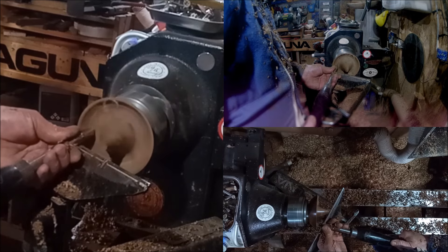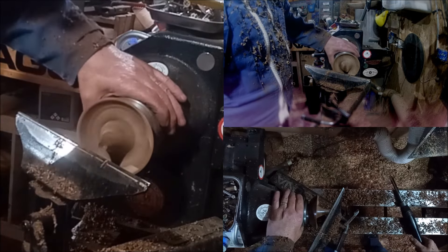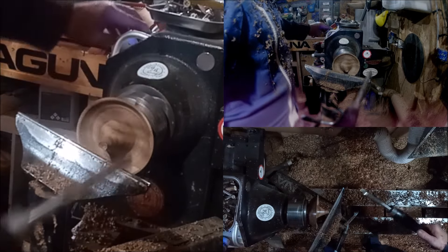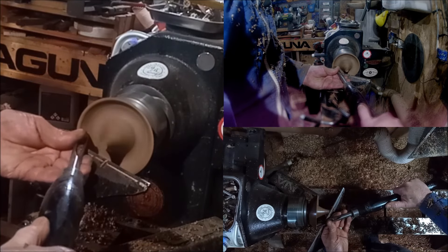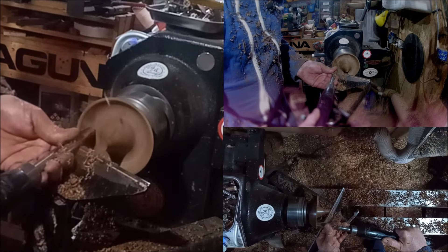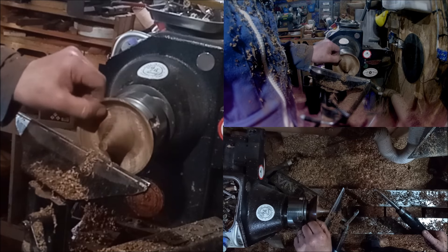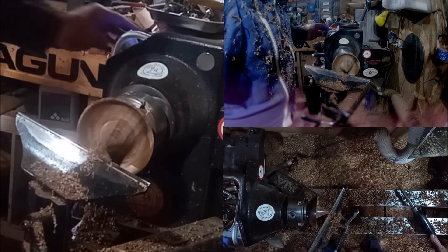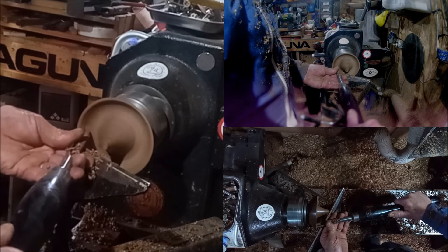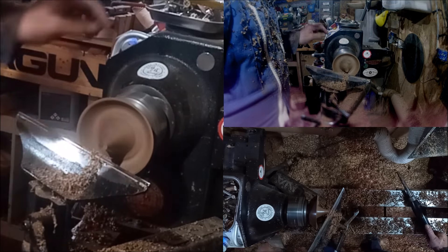What I'm looking for on the bottom of this is a nice curved transition. And there I got a catch. I'm going to leave that in as always. Luckily it didn't do too much damage — I'm just going to have to recognize and clean up the outside here. That's the thing you've got to watch for if you're hollowing backwards: that you don't do what I just did. Luckily the catch is not too bad, so I'm going to make sure I cut it out.